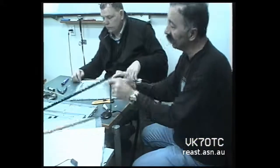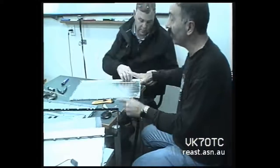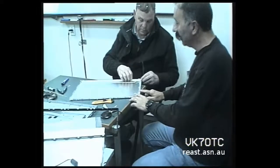We did one of these once before and we had the cable coming out the wrong side, and there is a little recess where the cable comes out, and because we had it on the wrong side and didn't notice it, when we put it back together again, the sharp edges went in and just cut the wire. We noticed it before we powered it on though.